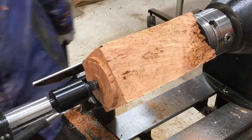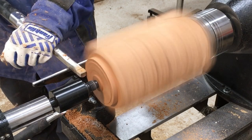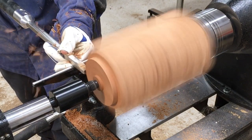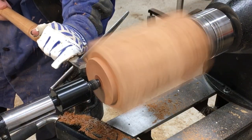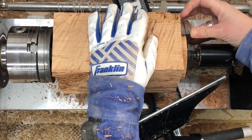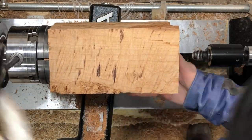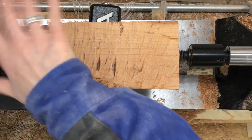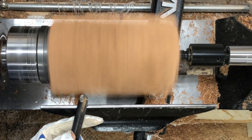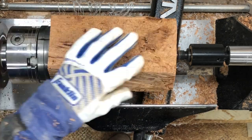You're going to get condensation on the outside of that stainless steel because it's only a single wall. It's not a double wall vacuum sealed insert like you would have in say a Yeti cup. I was a little concerned — on the first one I made I followed the instructions mostly and I epoxied the liner into the wood part, and I think that is eventually going to be an issue. I think you're going to get condensation in there that's probably going to get yucky after a while.